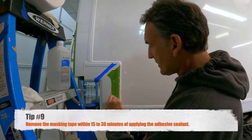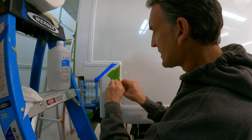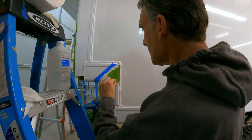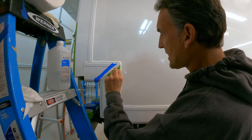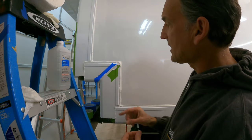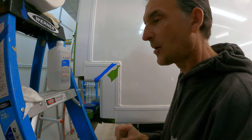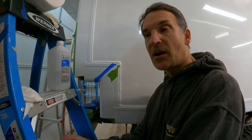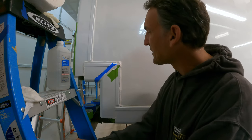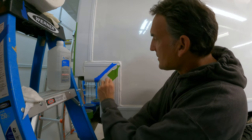This is a tricky spot because the only clean edge is right up against the caulk I just did. I'm peeling the tape towards surfaces so I'm not pulling the caulk away and flinging it. In this seam I've got a lot of overlap, so I can try scraping some of the excess off with a paper towel while there's still tape to capture the overflow — that way the extra sealant lands on the tape and not spread around on the surface.